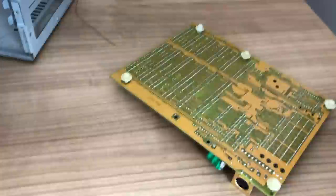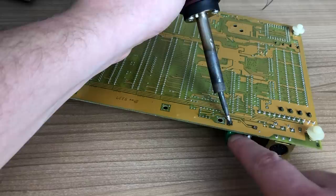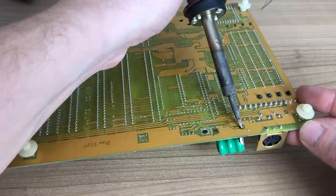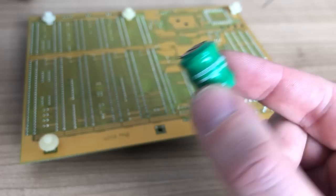I'm going to flip the board and take out my soldering iron to get rid of this battery. We're just heating up the pins, which can take some time. But as soon as you see the solder melting, the battery should pop right out. You might need to give it another go — and then we have the battery out.